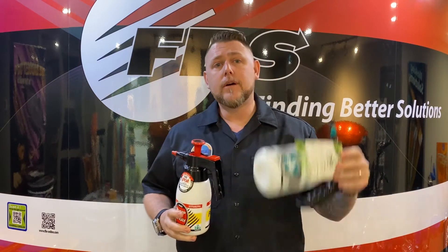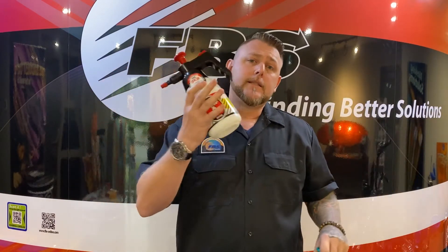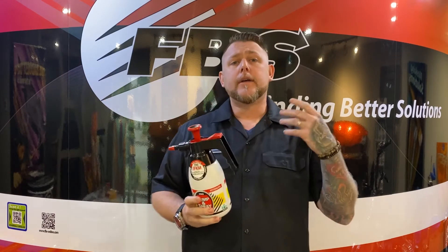Why? Because chemical pump sprayers over time — this guy's been around 20 years — what you don't know is there's a new king in town. It's all about chemical compatibility: seal composition, plastic composition, actually working with the chemicals at hand. Making sure you have the right tool for the right job. Because the biggest problem in this industry is putting the wrong chemical in here and having these guys die. If these guys are only lasting three to six months, guess what? You got the wrong chemical in there. It's not a matter of if it'll fail, it's a matter of when it'll fail.